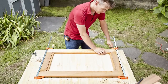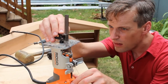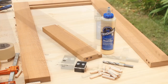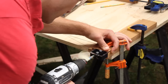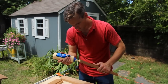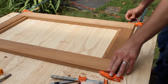Next up is the door frame. It's made of five-quarter boards to give you a little more strength than plain old one-by-fours. The first step is to clamp the stiles on the edge of the table. Chuck a three-quarter-inch straight bit in your router and set the fence to keep the cut at that width. Start shallow and make several passes until the rabbet is three-eighths of an inch deep. Now, the frame is held together with dowels. To drill holes for them, clamp a doweling jig to the stile flush with the outside edge and make a pair of holes three-quarters of an inch deep at each end of each stile. Use the jig to make a complementary pair of holes on the inside edges of the rails at each end. To assemble the door, apply glue to one end of the dowels and insert them into the rails. Then glue the stiles and fit them into place. Use bar clamps to hold the frame together and then check it for square.